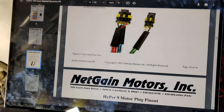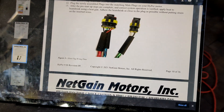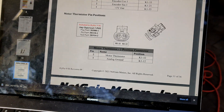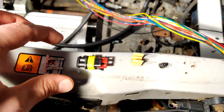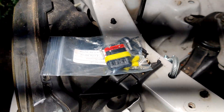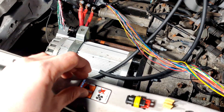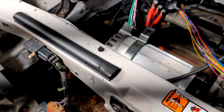In the user manual it shows you which foil corresponds to which plug. The green foil is for the thermistor. If you scroll to the next page it has the pin-out: pin one is the ground and pin two is the thermistor connection for this plug. I have the plug right here — it came in a little bag with this plug and the other four-pin connector, along with the pins and some waterproofing plugs.